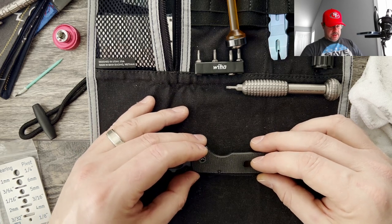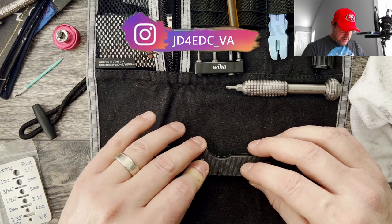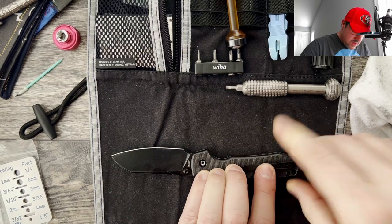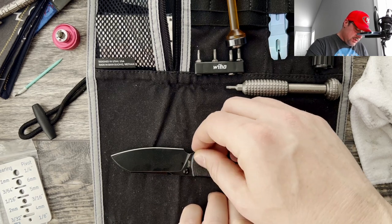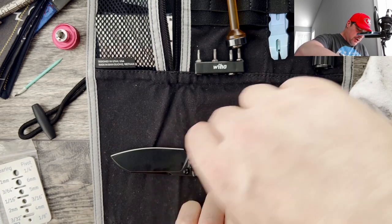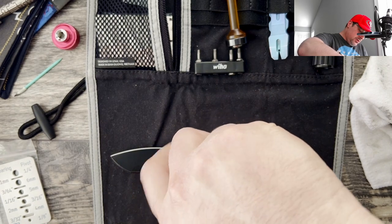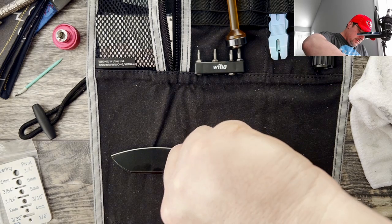So I'm going to back up and take a look at where the spring is. There it goes. So it is definitely in place. Everything just kind of fell back together, guys. Go ahead and grab your T8 and your pivot, reassemble that, and then you'll install that screw that you took off from the other side to this side. And all you need, it's a 2-screw construction. That's all you'll need to take apart are these 2 screws when you go to disassemble for maintenance.